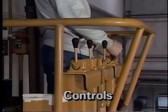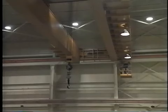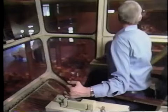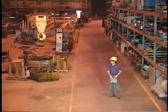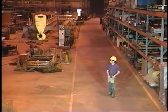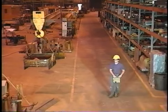The control system allows the operator to maneuver the crane. In cab operated cranes, the controls are located in front of the operator for easy access. Cabs may be attached to the bridge or trolley and move along with the load, or they may be stationary and separate from the crane. Stationary cabs are sometimes called pulpits. Cranes without cabs are maneuvered by controls that are operated from the floor. The operator walks along with the crane and directs its motions. Because of their proximity to the load, floor-controlled crane operators must be extremely careful not to trip or place themselves or others in a potential pinch point between the load and another object.